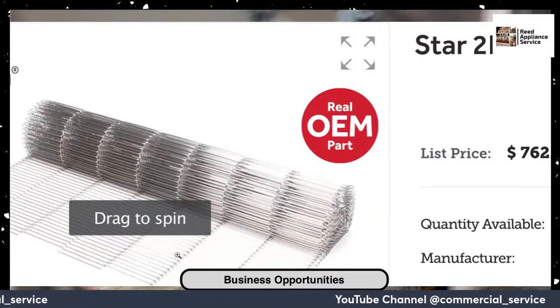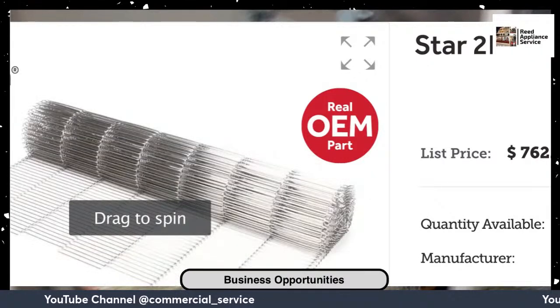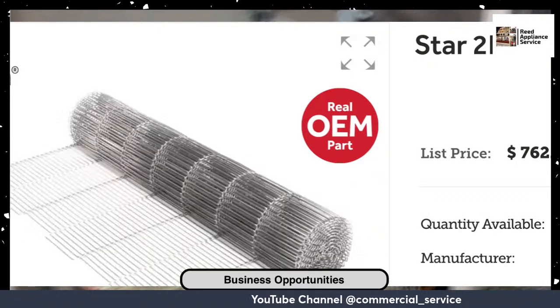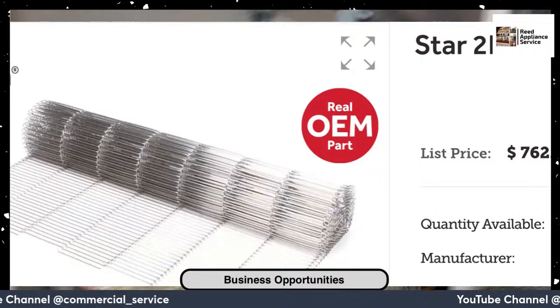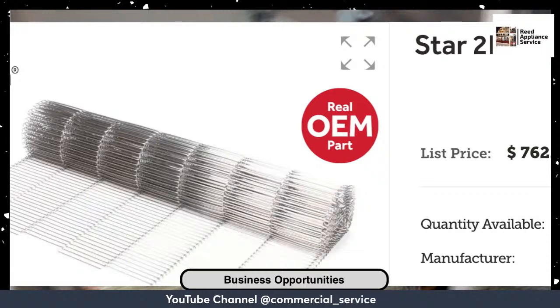Now you do have the option of repairing some of the links. It gets to be a little monotonous. It gets to be a pain trying to fix these chains. Most times we just opt to just go ahead and change the whole belt. What happens is the heat allows these belts to stretch, and then now they don't line up quite well with the sprockets, with the turning.